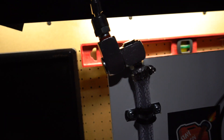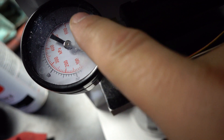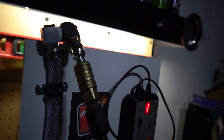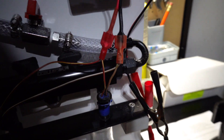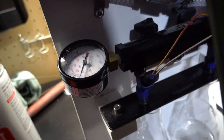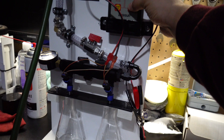We've got it on and we're going to turn it to mode one. I'm going to fill it up with carb cleaner — it's all the way at the top. I did spill a drop on the gauge but it's okay since we'll be in a range around there anyway. Nothing went through yet because I haven't opened up the ball valve. My compressor is set between 40 and 45 psi. I hooked it up — this is why I chose this contraption, so I can just shoot air up into it. Opening the valve now, we got about 30 psi, so let's go up a little bit. Now we're a little above 40 psi, which is around the middle of a good fuel pressure.